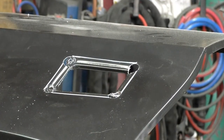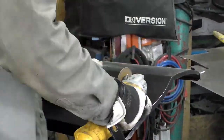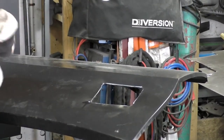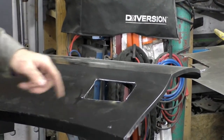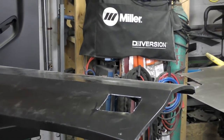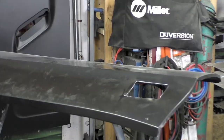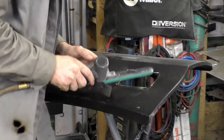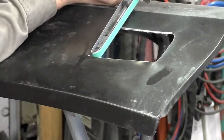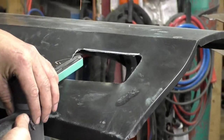Let's go ahead and get the gloves and goggles on and start cutting. There's plenty of different ways to cut this out — you don't have to just use a cutoff disc. We did cut a little bit in there but not a big deal; we'll clean that up and if we have to we'll just weld into that. Next thing we're going to use to clean it up is the bandsaw — the little miniature bandsaw — and we're going to really get our arches in there and straighten this area out. The end is a perfect match for our hole saw to get the curvature right.